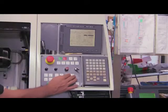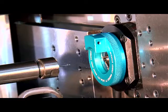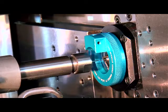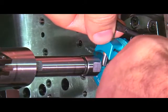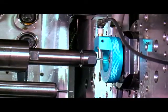Using the machine digital control, bring the tool into the work position by moving the spindle to its theoretical reference value. Once the tool is in position, adjust the probe so that it is within a few tenths of a millimeter from the tool body.